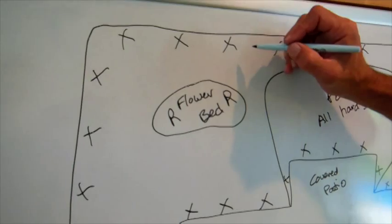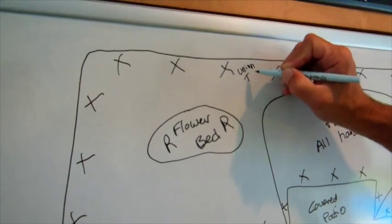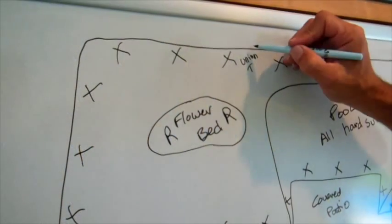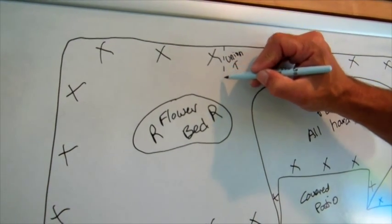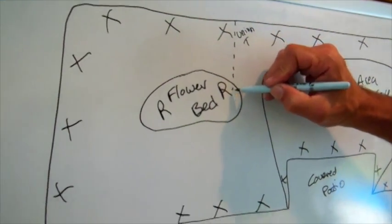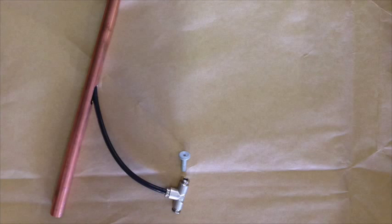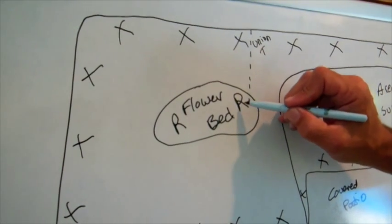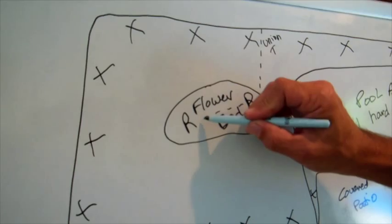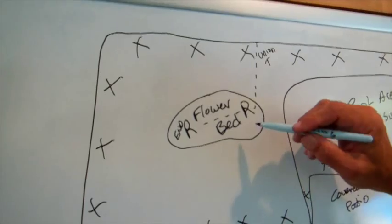At this point, at the shortest distance, you're going to install another union T. You'll cut the line, cut your tubing, and install a union T, and then you're going to run a buried line over through your grass into the riser. Risers have T's on the bottoms of them but come with plugs, so you can make each riser either an end or a T riser. The first one's going to be a T riser, the line will be buried, and then the second is going to be an end riser — you put a plug in the T and that's where you end it.